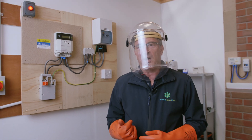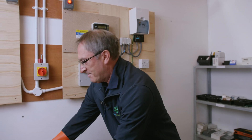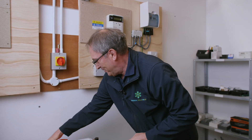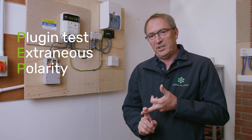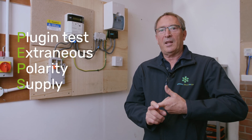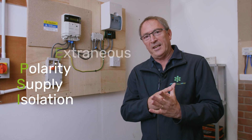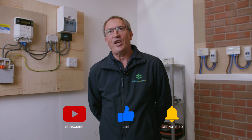I've now done all the testing. I've proven everything's not live. I've got the shroud in the cut-out. I can now remove all my safety equipment — the visor and rubber gloves. That's going through all the test procedures, hoping to make it easy for you to remember by using PEPSI. P for your plug-in polarity test. E for your extraneous metalwork. P for your polarity at the meter and inside the cut-out. S is the supply — checking live, neutral, and earth. And I is isolated, making sure that everything is dead. If you've got any comments, please pop them in the box below. If you like this video, please hit the like button and subscribe to the channel. I'm Michael, thanks for watching this Knowledge Hub. Hope to see you soon.